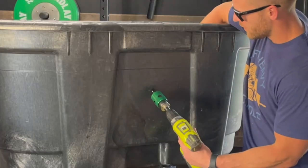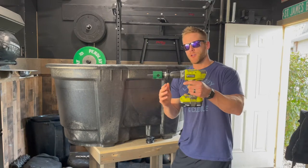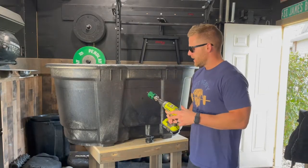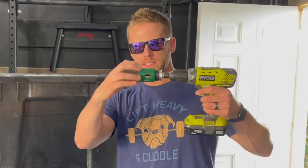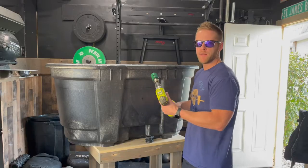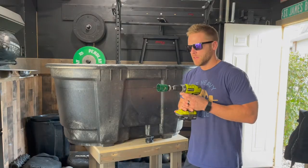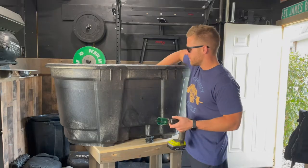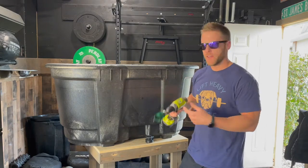What this does is it acts kind of as a pilot hole. So when we drill, we'll line up the drill bit on the crosshair. It'll drill through the material first and that'll keep you on track as you drill the actual hole into your tub. The reason we're working outside-in is that these can be a little bit tricky to work with. Once the teeth kind of grab onto the material, it can kick around and scuff up the outside. Once this hole is started and this thing starts chugging, you can let the hole saw do the work and it'll be a much cleaner hole on this side.